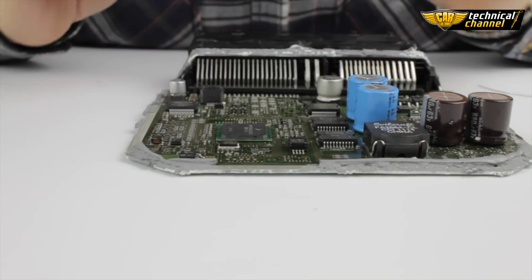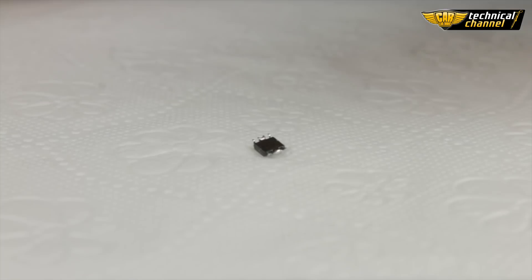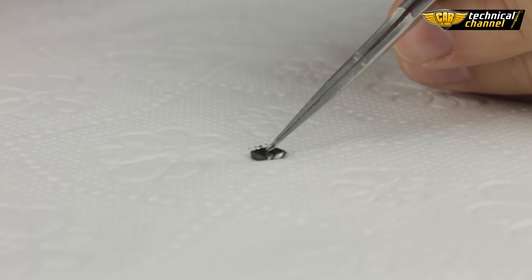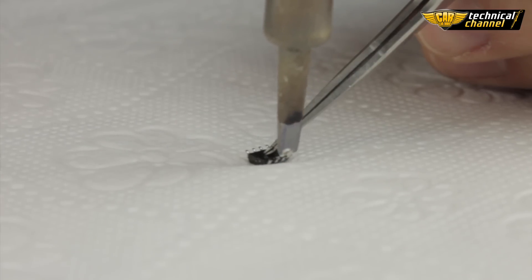This is our SMD memory. Firstly, let's clean the memory legs. If the memory legs are soldered together, you have to hold the plate with pliers and use the iron gun to remove the excess of tin. Now, using a polishing block, clean the base of the legs. To not bend or damage the legs, do it very gently without force. The memory moves along one axis.